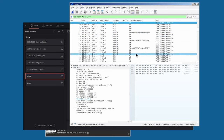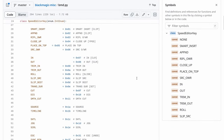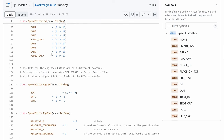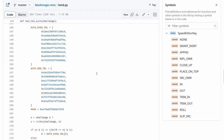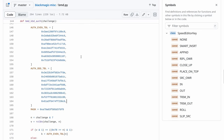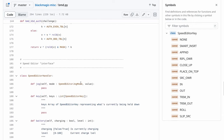There are two approaches: write a program to probe the keyboard with random numbers and eventually reverse-engineer the keys, or look on the internet to see if someone has already done this. And it turns out someone has — including deciphering all the key codes, what the various packets look like, where the LEDs are set, and most importantly how the authentication challenge works. Here are the keys. It's slightly disappointing I don't get to figure it all out myself, but only slightly — because this looks really nasty. I don't know where the original author got the keys from; possibly they dumped the firmware, or maybe they used cryptanalysis.